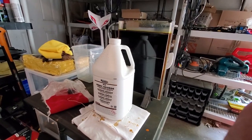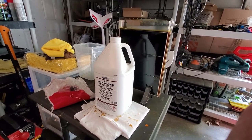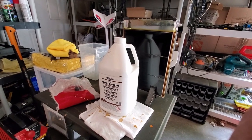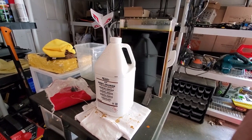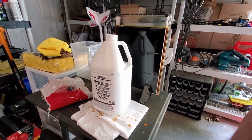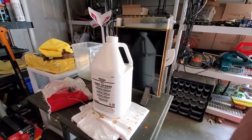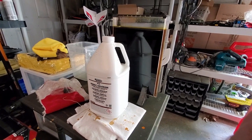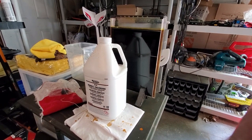For the etching side of things, you need an etchant — this is ferric chloride solution, and it also has hydrochloric acid in it, so that is super nasty stuff. You don't want to get that on your hands or in your eyes either, so definitely gloves and eye protection. Behind that you can see the little bath I use — it bubbles air through the mixture, which greatly speeds up the etching process.